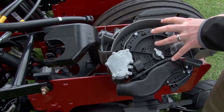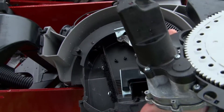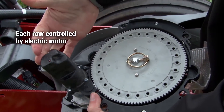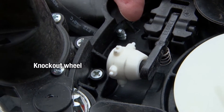It's about features like the V-set, V-drive, electric drive. So it can take a 12, 16, or 24 row planter and really take it down to a one row planter at that point in time, where I can independently vary the population control for different populations, but also contours. So if I'm going around corners, the outside row and the inside row are all planting at the same population.